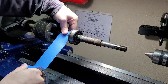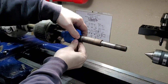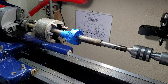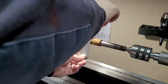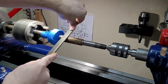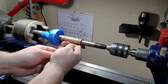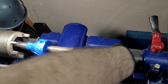Now we need to get the shaft cleaned up, and to do this we're going to take it over to the lathe. Since these bearings are pressed on there and I don't want to damage them, I am sealing them up with masking tape to keep the dust and grime off. I'm stabilizing it on one end with my live center and have it in a three-jaw chuck, then going over it with some emery cloth to get off some of the rust that's built up over time. I'm also using a file because there are a couple of high spots from where someone used pliers or vise grips to grab the shaft to torque the nut holding the grinding wheel on or off.